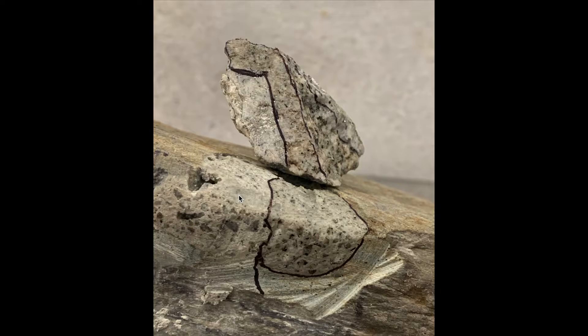Next is the variegation — how the surface appears — because stone, especially this stone, has a lot of variation in it: little chunks of black and little spots of black among the gray areas of various grays. I did that by, as you saw, crushing up the stone into various size bits. Mick and I mixed them with the epoxy and filled it, then I ground it with the diamond grinding wheel to expose the insides of those chunks — creating what you'd call a texture, though it's really a visual variegation.